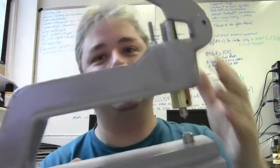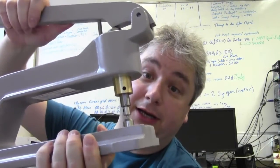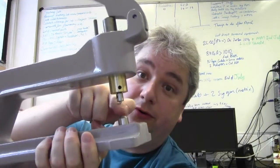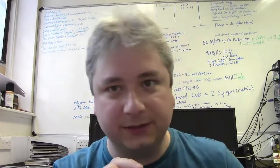And this is the tool to actually do the riveting with. Unlike the via pins where you can populate the entire board at once, with the riveting system you have to do it one at a time — just like the wire method. The reason is when you press down on the riveter, your board fits in here with the rivet and you can only do one at a time. If you knock your board or have trouble getting it out — because the rivet closes up on the centre pin of the riveter — you might actually knock out all the other rivets.